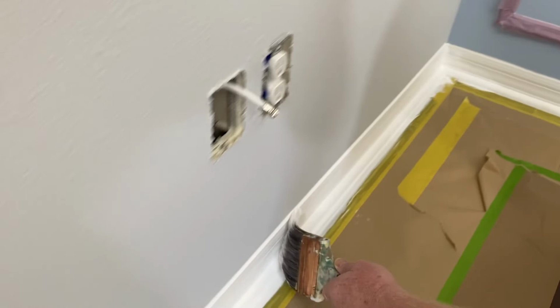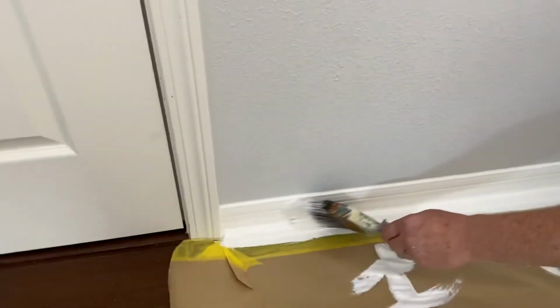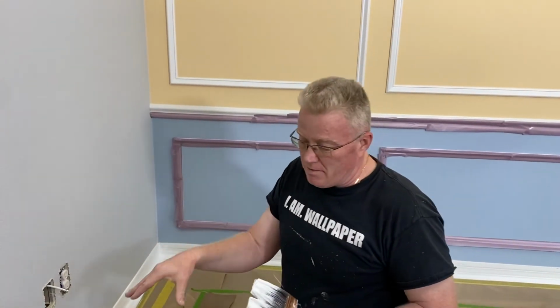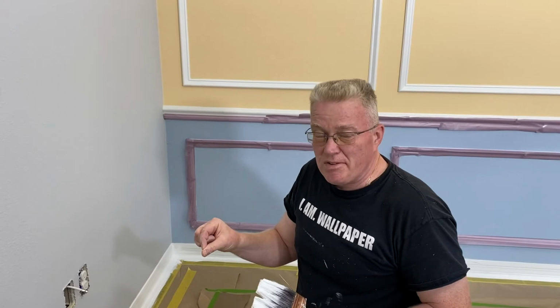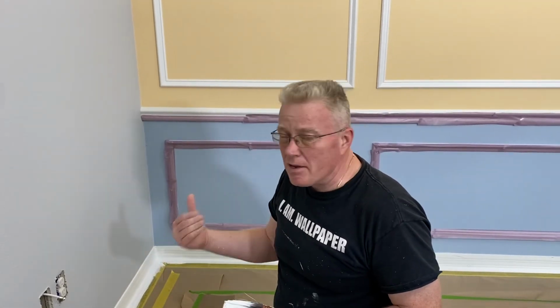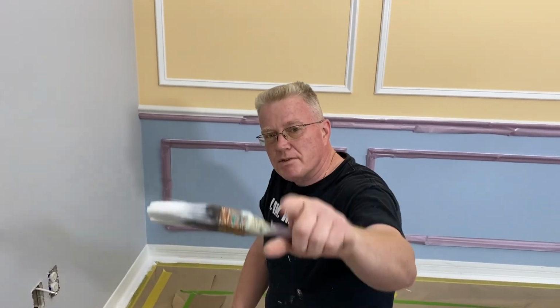Watch that. 1, 2, 3. Go to the end. Pull it. And we unite it in the middle. Pull. And that is how you paint base trim with a small lip. That's no more than 3/16 of an inch. That's how you do it. Without tape, breaking your back. All right? Any questions? Leave a comment. I'll see you on the next video.